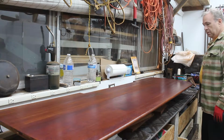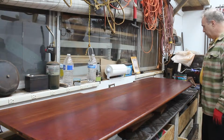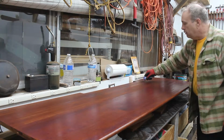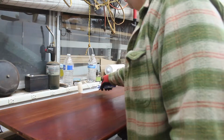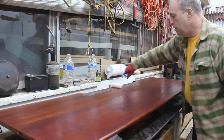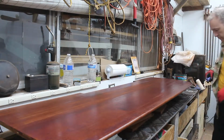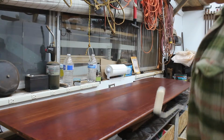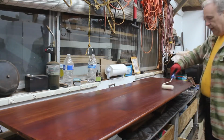Usually it comes in sort of a blend with mineral spirits or something like that. And you have to put on many coats before it starts to build up enough to where you think it's going to be a stable finish. And even then, it's not going to be very durable against any kind of moisture. So if somebody puts a wet cup with condensation, oops, then you've got a big problem. You end up with white rings in your finish. I remember a cabinet my dad had built, speaker cabinets, and during parties people would put their cold drinks on the cabinet. Before the end of the evening they'd be all white with rings everywhere all over the surface.